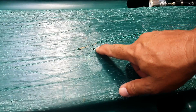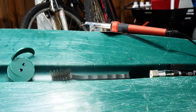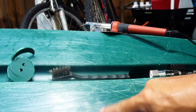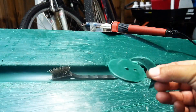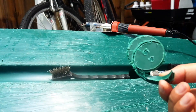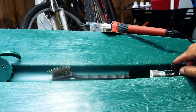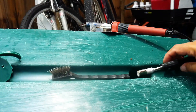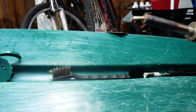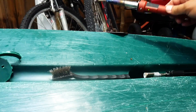Here is our little pin hole that we need to fix. We're going to do a quick step-by-step patch and we'll be good to go. The equipment I use is pretty basic: a wire brush to give it a quick clean — I've already washed it off — a piece of scrap plastic from a rod holder drill-out, a little hand torch to quickly heat things, and a small iron that I'll use to melt and combine the plastic so they basically become one.